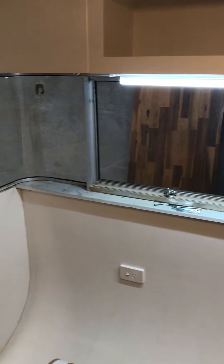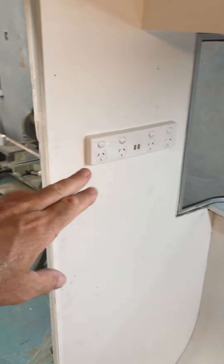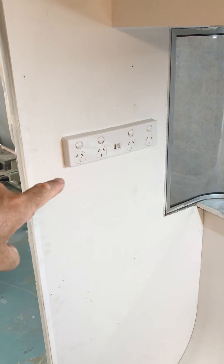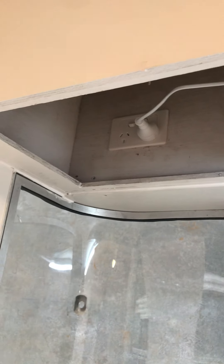I've just run through all the power that's been put in — we've put loads of points in there for you. Right at the front door where your kitchen bench will be, you've got what's called a four gang — four outlets and two USB — so you can charge up your phones and whatever you like there. Underneath where the range hood is going is another double point, one for the light and one for the range hood. Underneath there is another power point inside your kitchen cupboards for anything you might want to run down there — your toaster oven and so forth. Over on the other side there's another two-gang outlet, and then where your fridge is going to go next to your lounge, there's a single-gang outlet for your fridge.